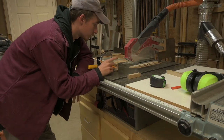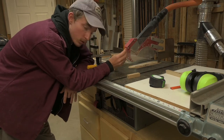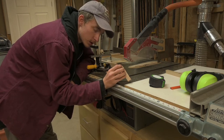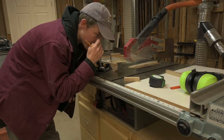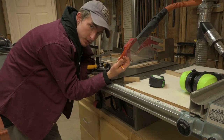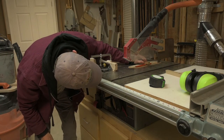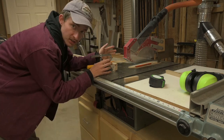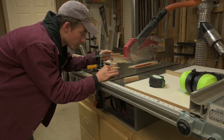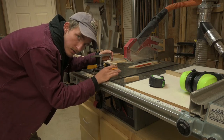I've cut everything to length on the table saw using the miter gauge with a stop block. I've lowered the blade to a quarter inch height. These are three-quarter-inch squares, so if we take a quarter inch off the top, bottom, front, and back sides, that'll leave us with a quarter-inch tenon. I've used a carpenter's pencil to mark it, set the saw to meet that line, and on the stop block I'll mark it and move it a half inch towards the blade — that'll be the shoulder for our tenon. I'll go around, cut each side, remove the block, and then cut the rest of the tenon out.